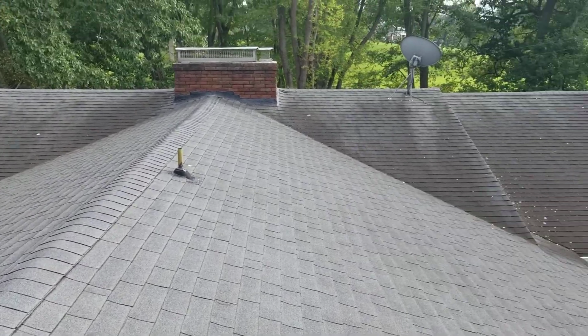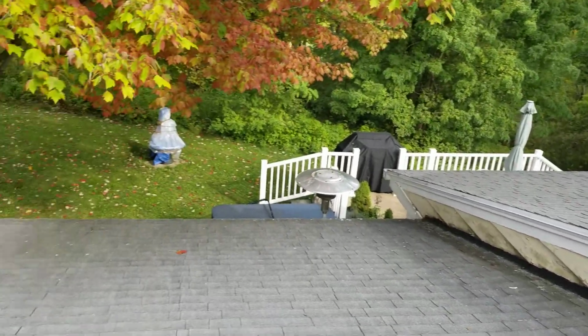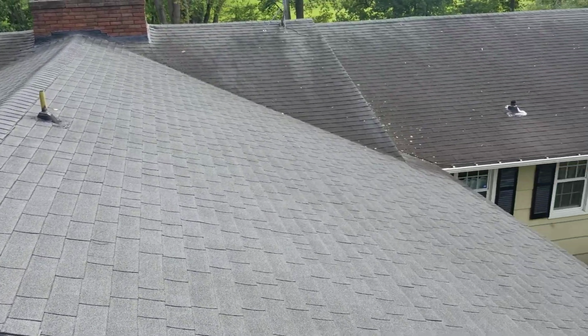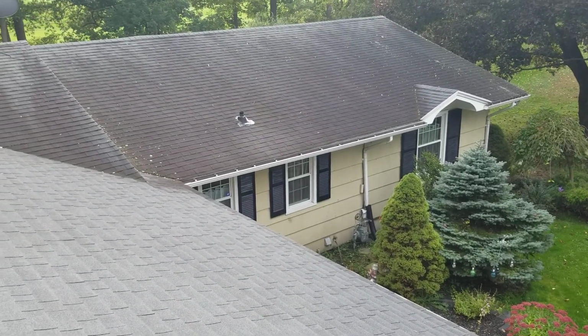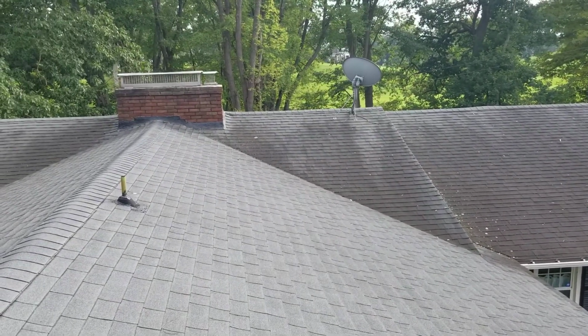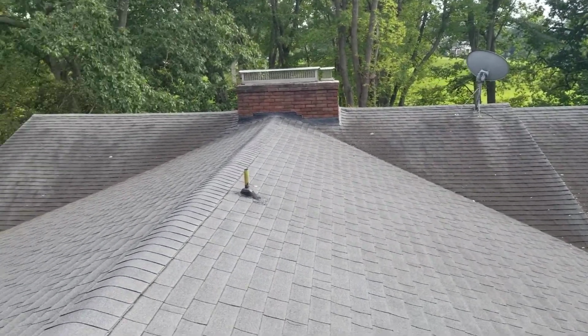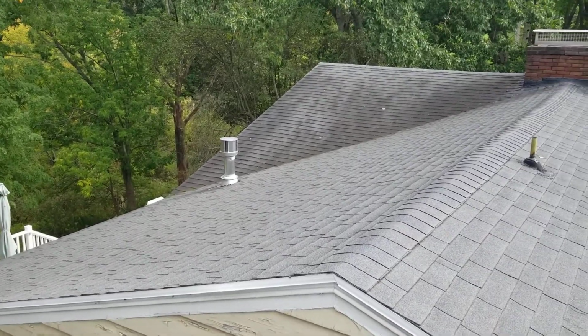That heating system right there probably is creating a lot of ice. But there isn't one roof vent in this house, which is astonishing. You have to have airflow in the attic. Unless this is all foam insulation in the attic, that's the only other reason you wouldn't. The satellite dish, we'd find out what the deal is on that. So let's go down, get my tape that fell on the ground, and go around and grab these gutter measurements.